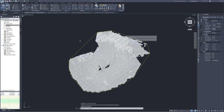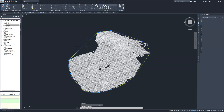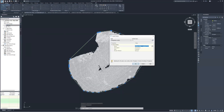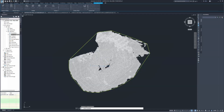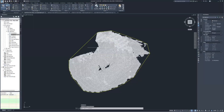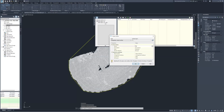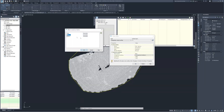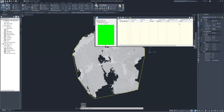Now I'm going to calculate the volume using those DXF files from the iPhone and see if the results on Civil 3D match those from LiDAR X3. For pile 1, I'll select this TIN and extract the boundary so we have an exterior line to build a new surface — we'll call this surface Base. Then we can add that boundary line. In the volume dashboard I'll create a new volume, call it Pile 1 iPhone, with the base surface as Base and comparison surface as Pile 1. We've got our pile at 26.74 cubic meters. For pile 2 we got 199.73, and pile 3 is 62.02.